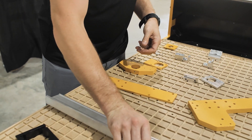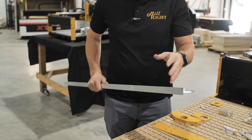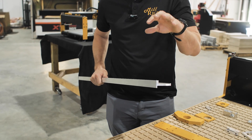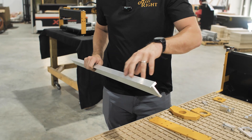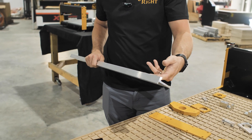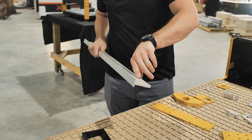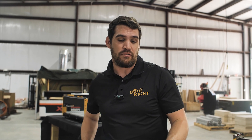This is a brand new custom extrusion — the production version will be anodized. This goes back to user experience: you're going to be able to set your gear rack for the X axis better. It has machined places where the gear rack pulls in, and the linear rails index up against this point. It makes for faster assembly — everything is going to be more aligned and you'll get up and running faster.